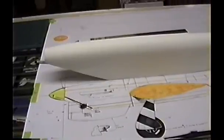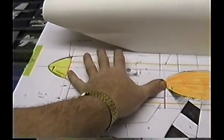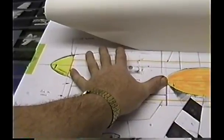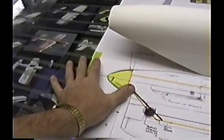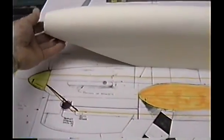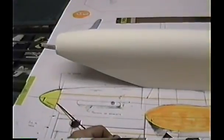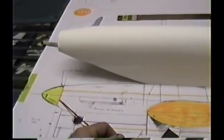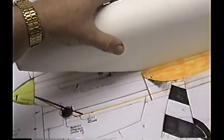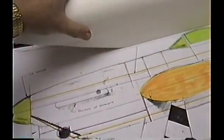While Mike is making his doublers, let me suggest that anybody making a fuselage and anticipating using a Saito 72, you don't want to make the nose 10 or 9. We're using this 8-inch calculation. I did kind of a seat of the pants calculation, and Noel Drindak did a scientific one, and we both came out with an 8-inch nose moment arm. So the Typhoon, as you probably can see, is going to wind up having an 8-inch nose. Mike's Cardinal is going to have a Miss Ashley type tail.